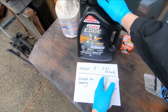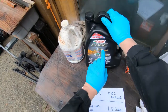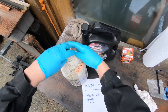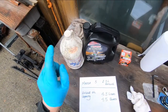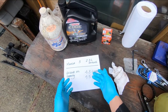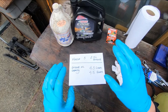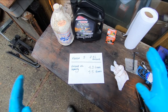We've got 5W20 engine oil - 5 liters here which is too much - and I'm also going to substitute some of the oil with Lucas heavy-duty oil stabilizer. I'm going to put about half a liter of Lucas, so it'll displace that much oil - about three and a half liters of oil and about half a liter of Lucas. Once the engine is started and back down off the ramp on level ground, I'll let it sit for about half an hour, turn off the engine, then dip it and top up as necessary.